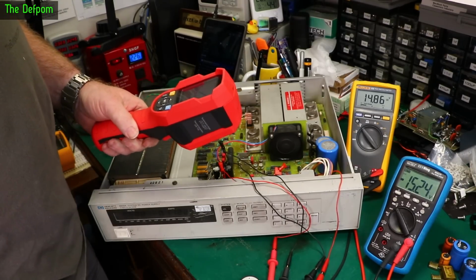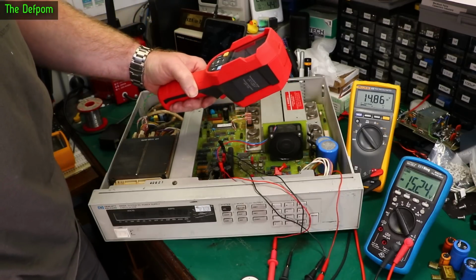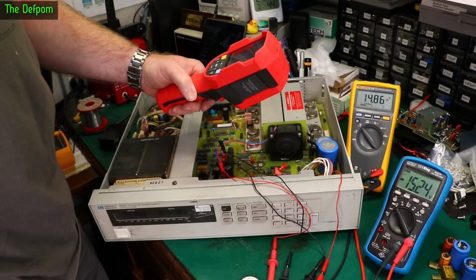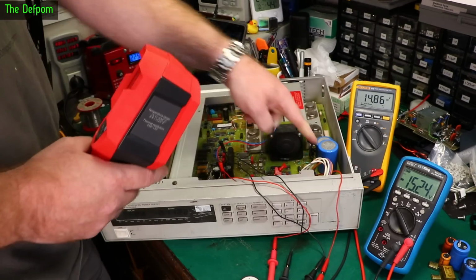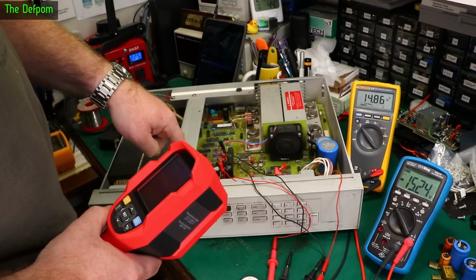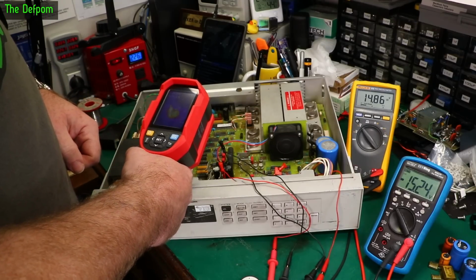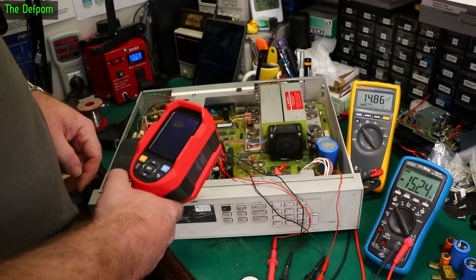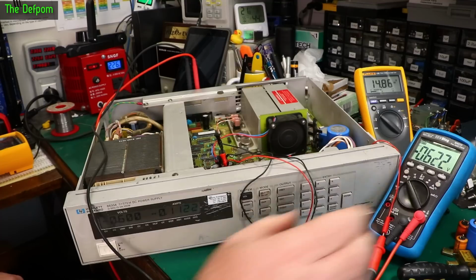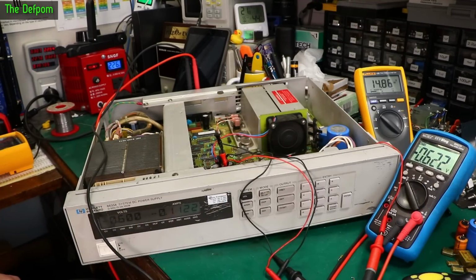Okay. Rear panel's looking fine. I've got something getting, yeah, 62 degrees, 66 degrees. There's a power resistor over there. So yes, those heat sinks are getting pretty hot. I'm glad I changed those caps. I think that was a good choice. But I'm not liking the fact there's another transistor there which doesn't have a heatsink on it, which looks like it actually needs one.